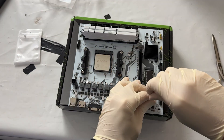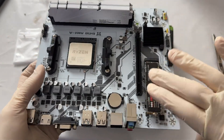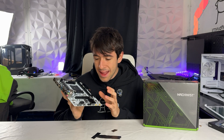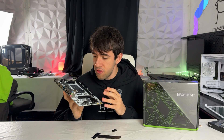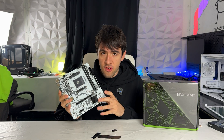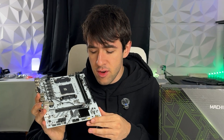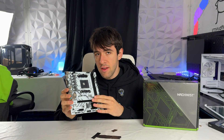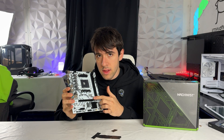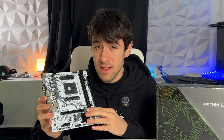It has a full AM4 backplate with a standard AM4 mounting bracket. There's USB 3.0 but no USB-C, which is to be expected. There's a complete lack of RGB control on the motherboard, so if you want RGB you'll need an external controller. The main PCIe x16 slot is also not supposed to have PCIe Gen 4, but they claim it does — and little spoiler, it actually does.